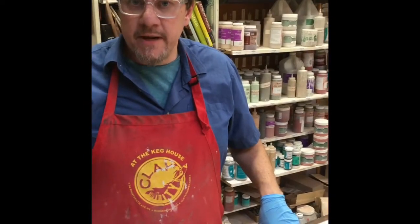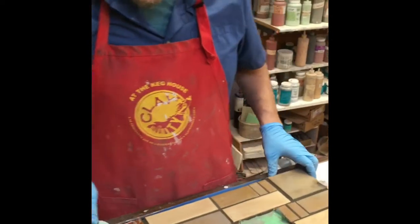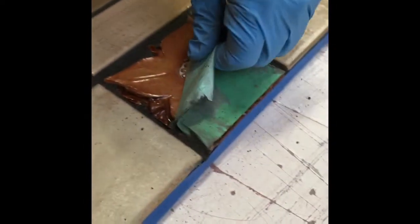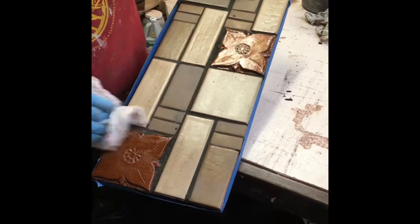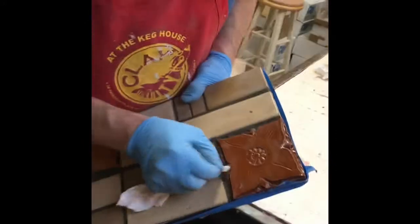Earlier we applied tape onto the bas-relief tiles. Now that we've grouted the piece and done the grouting around the edges, we're going to peel the tape off of each one. You can see the tile is in really nice shape — it doesn't have grout in the relief. We can clean off the tile and there's just a little bit of grout to deal with, not a huge amount. Now it's a lot easier to go in and clean up the small edges. I forgot my dental tools, but I can still clean it up really easily. It saves time and you don't have to invent new swear words, which is really important.